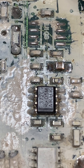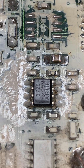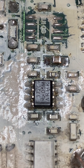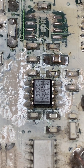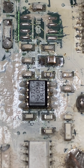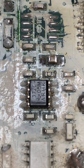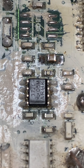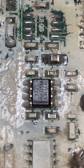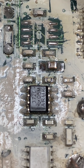It's normally a small value capacitor there — I can't remember off the top of my head. But what I've found is that some of these detectors — the ones that turn off, very hard fault to find — the detector will be running beautifully and then all of a sudden it'll go off. I think it comes up with over-current as well. I've cured it in the past by increasing the capacitor value. I've got a one microfarad cap in there at the moment — I think they're only a few nanofarads, the cap that was in there.